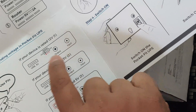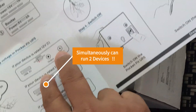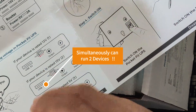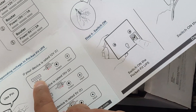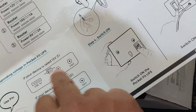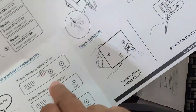Input will go in here and output will come out from here. The benefit of this device is that simultaneously you can run two devices — for example, if your modem is 5 volt you can take the output from the USB, and if your router is 12 volt then you can take the output from the 12 volt or 15 volt port.